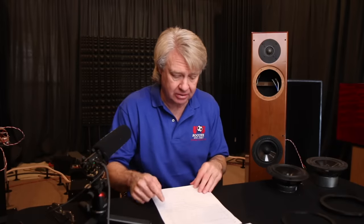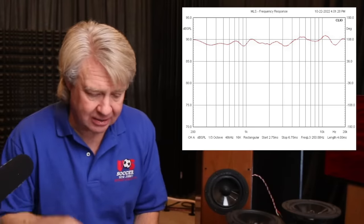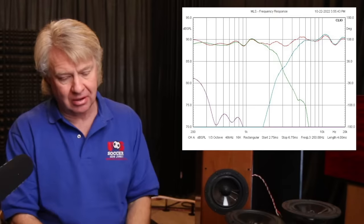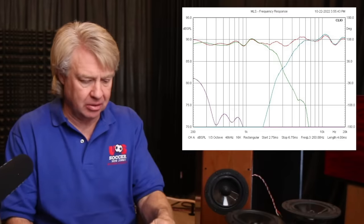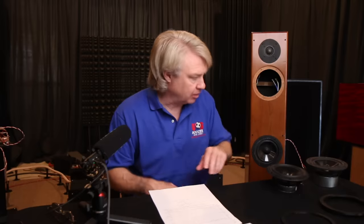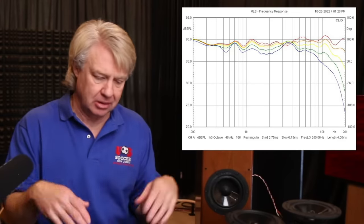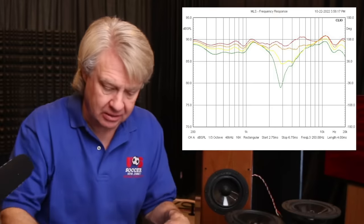We're able to put M130s top and bottom. Let's look at the new frequency response — pretty smooth. Looking at the individual driver responses and how they sum: I was able to extend the tweeter's range down as far as I could, crossing at 3000 Hz. The M130s needed to play out a little further to reach it, which was no problem. The lower M130 covers just the lowest frequency range by itself, with the tweeter crossing and getting a little help down low.